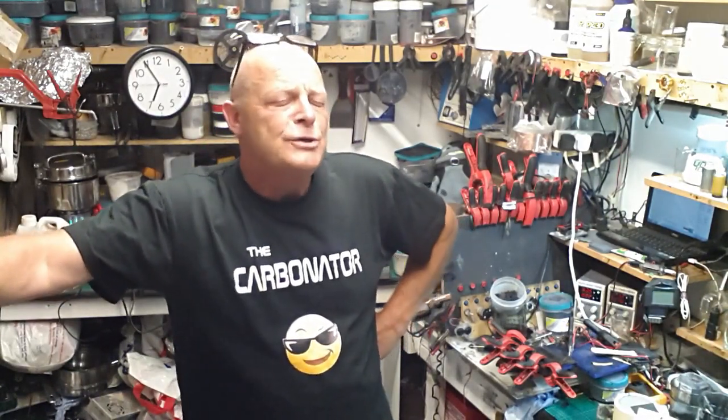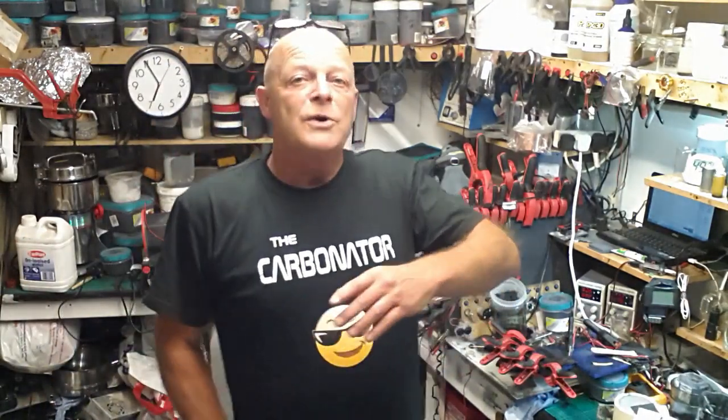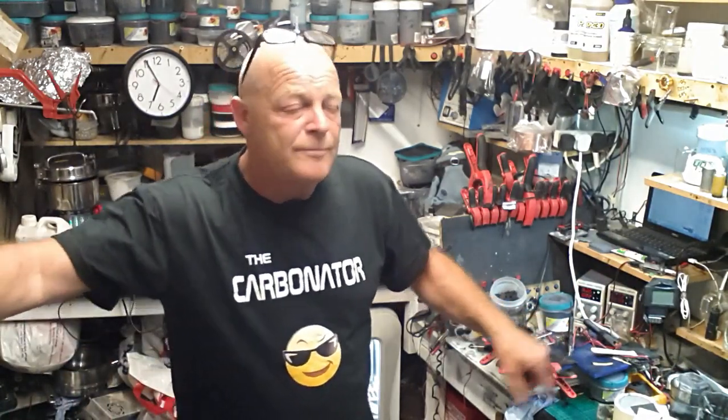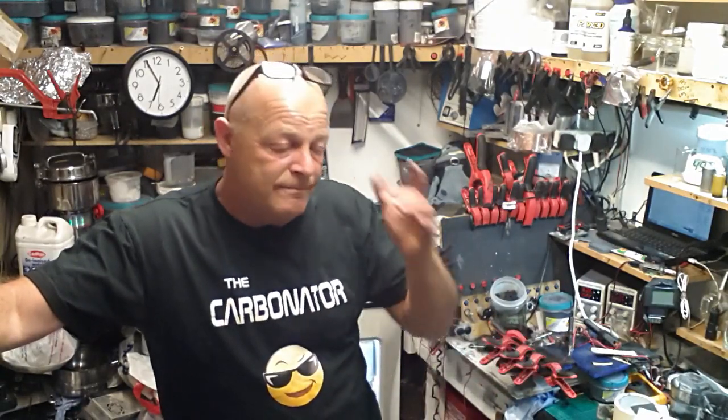The other thing I forgot to mention is that I'm moving towards changing the weight of the battery. I'm moving towards metal collector plates, and I've managed it with this particular battery on my negative, or my anode. I've got an aluminium plate and it's working phenomenally well, and I was working with that before I went away, and that's the way it is now, and it's the same one. I've got it to a stage where the aluminium plate plays no part whatsoever in the chemistry at all.